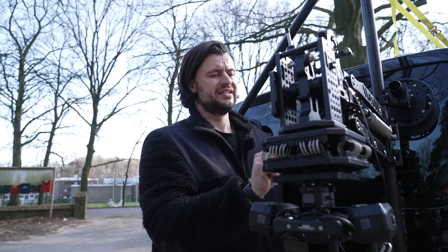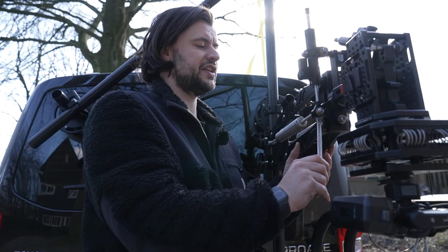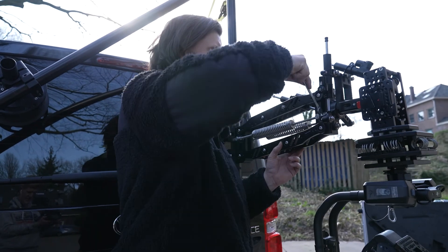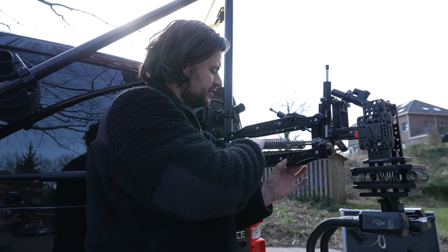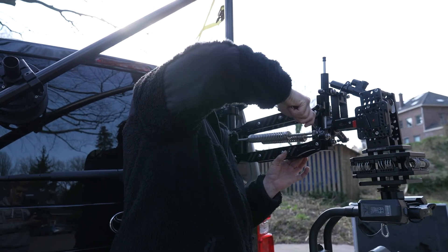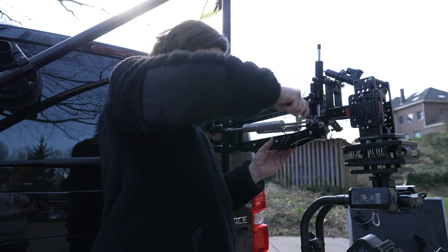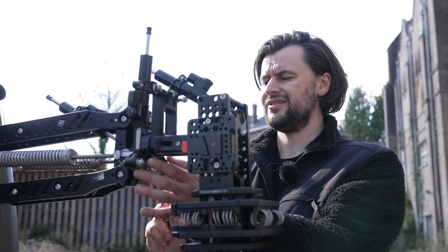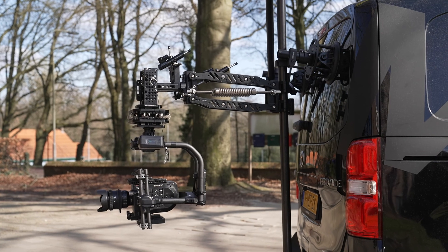The other side of the arm works in the opposite direction — turn the knob up for more tension and down for less. I turn it down for less tension. After a few adjustments on both sides — about five turns each — the arm is now level with the ground, in a straight line. That's important for the balance.